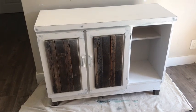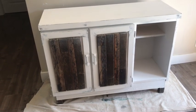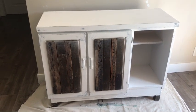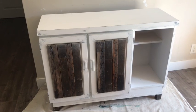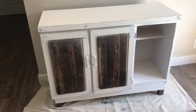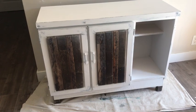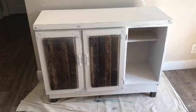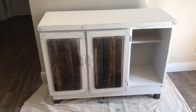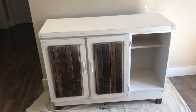This piece is pretty much finished. I've done some wet distressing and the paint is all finished. I've already clear coated the wood, and next I'll be putting a white wax over all the white. I do that because you never know when you'll get bleed-through, and the least amount of bleed-through comes from using white wax. If it goes a little yellowy, the white wax covers that and just brightens it and makes it better. So if you're not sure after all your hard work whether you'll get slight bleed-through, go with a white wax over white. Then we'll be ready for staging up pictures and it'll be available.